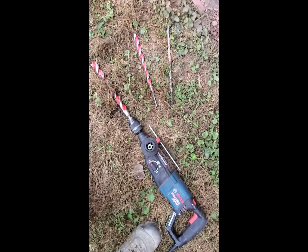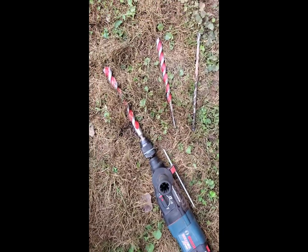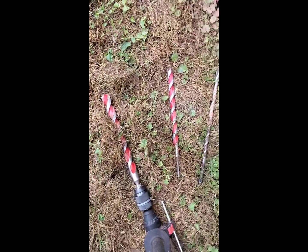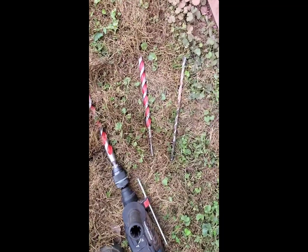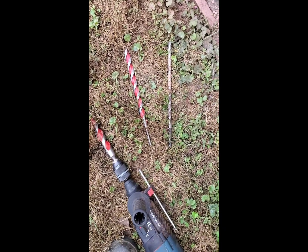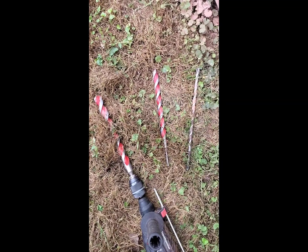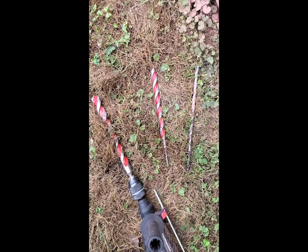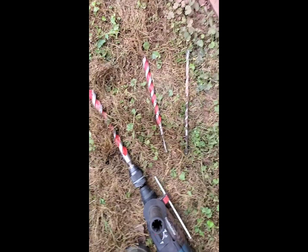When drilling your holes, you're going to need a good hammer drill, something that can handle it. Because my holes are so large, I'm doing my drilling in increments, with a 1/2 inch, 3/4, and then a 1 inch. It's a little bit easier to drill it out, a little bit easier to stay on your center mark. And then also I was hoping it would be less likely to blow out the backs if I did it in increments.